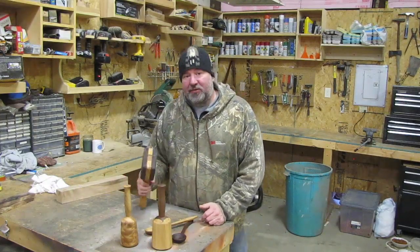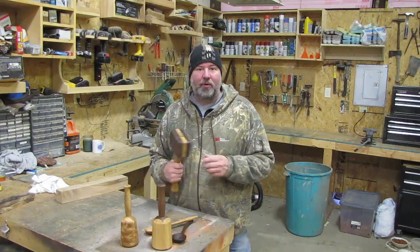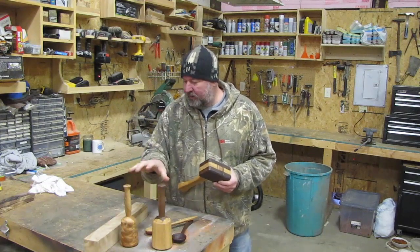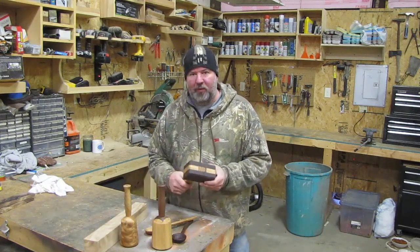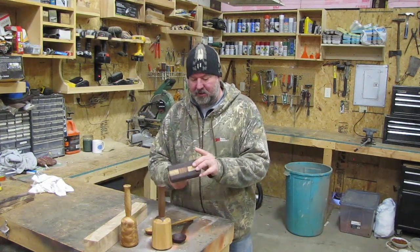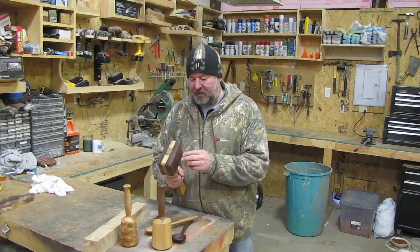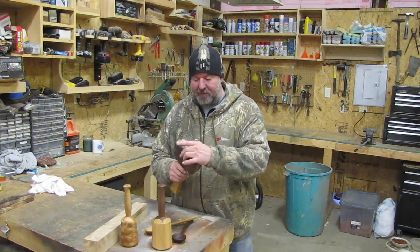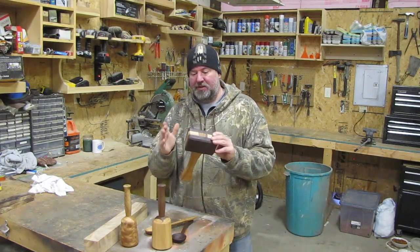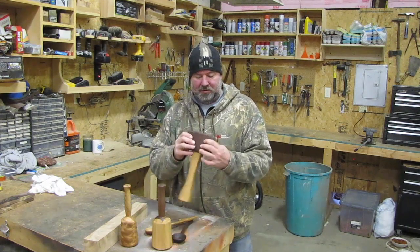While Matt's in the woodshop using the lathe turning the handle, I'm going to poke around for some hardwood. I know we want to use this elm for one of these, maybe do another one in walnut. But I want to find some pretty hardwood with a nice pattern or grain. Three-quarter inch stock — get three pieces cut, three and a half inches deep. Just do some six-inch blanks for glue-ups.